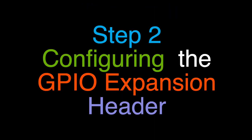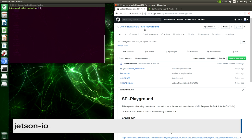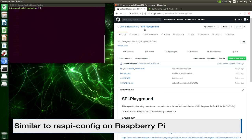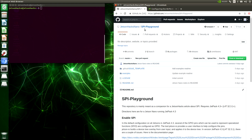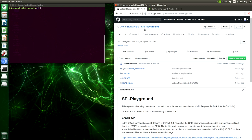Step 2. We need to configure pins on the Jetson to be able to access the SPI controller. We will use the new Jetson-IO utility to help us with this task. This is similar to the Raspi-config utility on the Raspberry Pi. After the demo of the display, stick around for a tech talk, where we will discuss a little more in depth how this utility works. While Jetson-IO makes the GPIO pin header configuration conceptually simple — you just specify these particular pins as SPI — what happens behind the scenes is slightly more complicated.